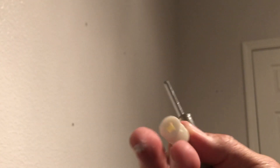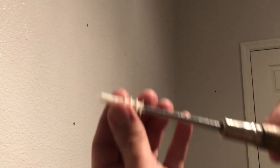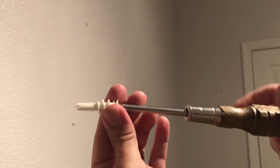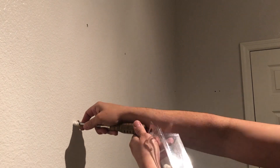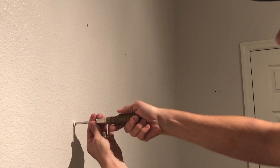These are pretty easy to use. You can see it's got a screw head and it's self-tapping — there's already a bit of a hole there, so you only need to thread in the tip. Just take your screwdriver, stick it right in the end, and rotate clockwise while pushing until it goes flush with the wall. I'll demonstrate on this hole right here since it's in front of the camera, then do the rest. Just like that — it's in. Do all the rest of the holes.